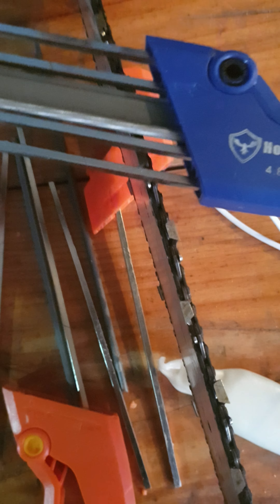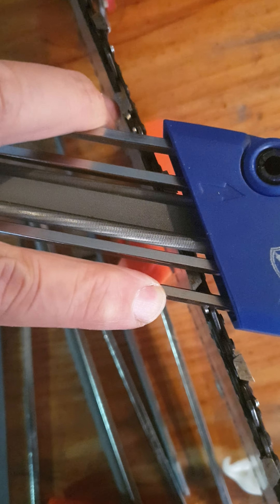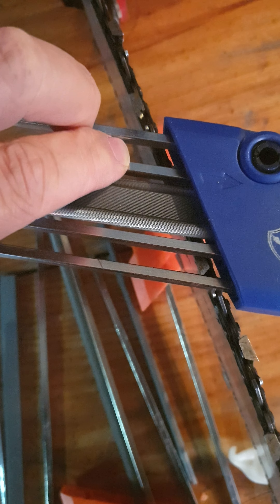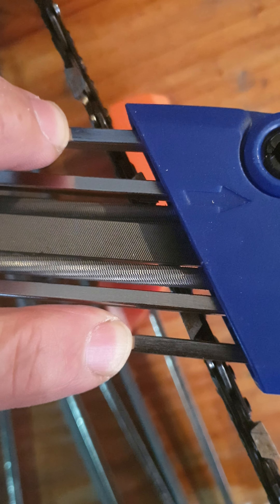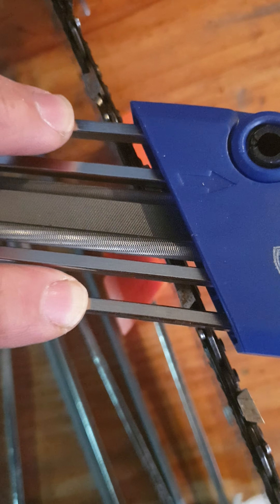Here's one guide rail and here's the other guide rail — it's too far off. This guide rail should be closer, further towards the back tooth over here, so that it sits on the tooth correctly. At the moment it's just wrong — it drops off the front. So that's one problem: sometimes it'll sit on top of the tooth, but other times it'll drop down onto the raker.